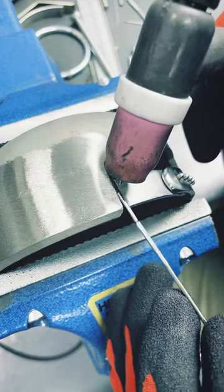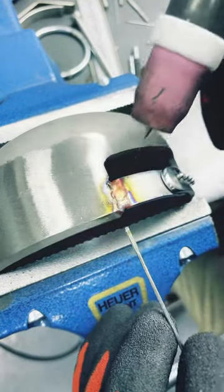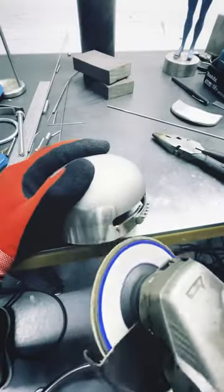There's a pretty large gap right here, so I can use this rod and my TIG welder to fill in the gap, and then I use my grinder to blend the whole thing and make it look seamless.